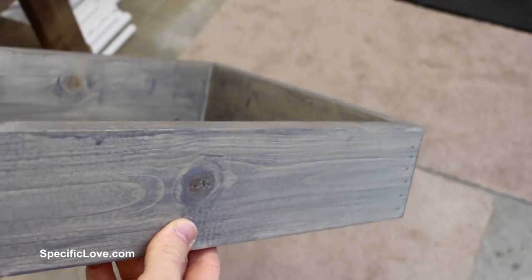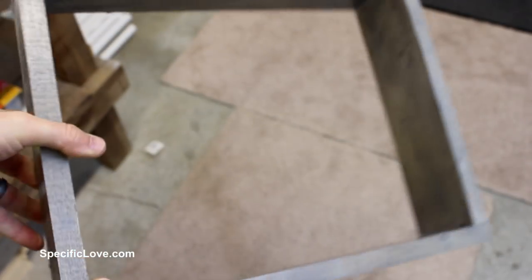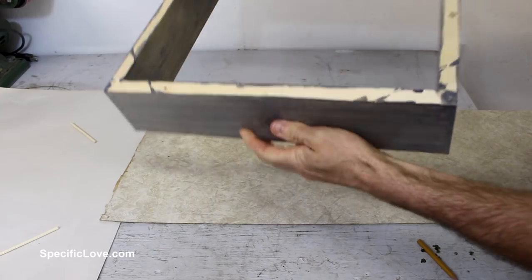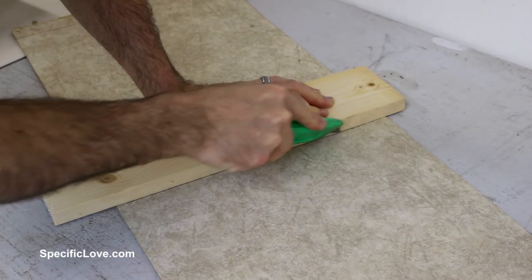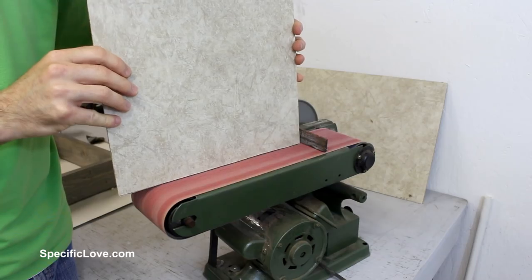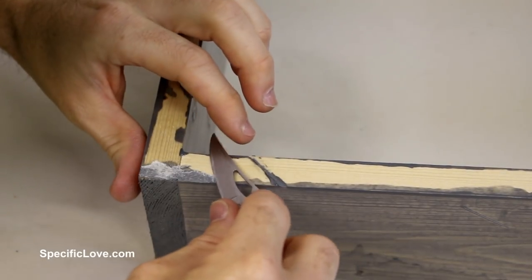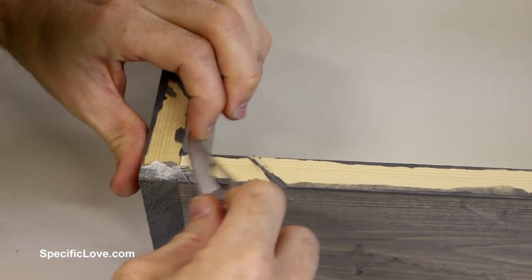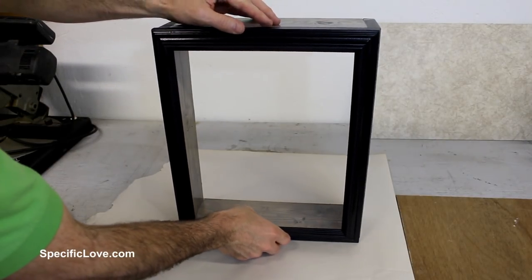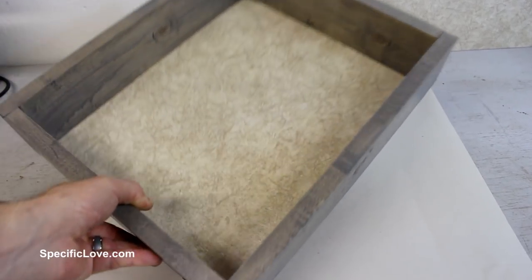Now that the black matches a lot better with the weathered gray, that's what we're going to go with. After the box was dry, it needed a strong backing that would give it strength and keep items from falling out the back. I had some old wood paneling with a weathered gray appearance that matched well with the box. It also happened to be the correct width, so I just had to trim it to the needed length. I took it to the belt sander and smoothed all of the edges. Looking at the back of the box, I discovered that some of the poly coating had leaked underneath and created some high spots, so I grabbed my knife and carefully scraped them off. I double checked the measurements of the frame and box one last time, then attached the panel with some small brown nails. The backing looked even better than I had hoped.